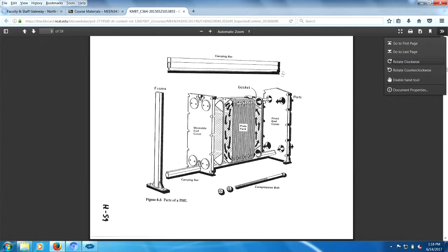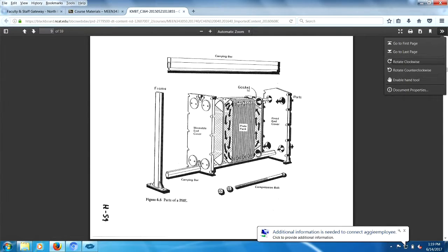If you don't open it up, you're going to keep it on, don't clean it, say for 10 years, this would be a great piece of equipment. However, you've got to recognize there are significant gaskets in here. And once you open it up, you have to buy a whole new set of gaskets. And it's quite a challenge to re-gasket this thing. Number one. Number two, since there are gaskets between each plate, I often say that this heat exchanger is a gasket. The heat exchanger is limited by the properties of the gaskets.